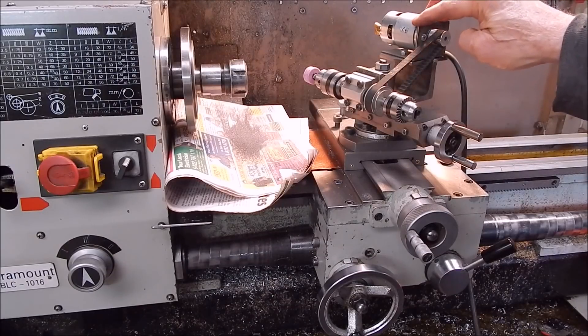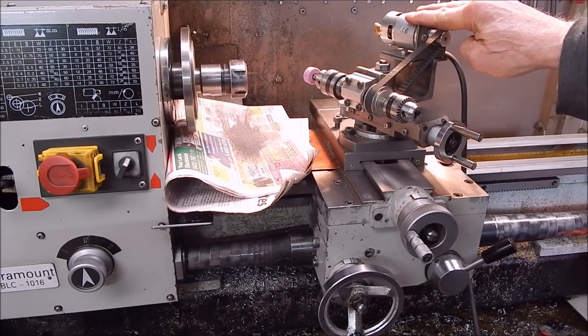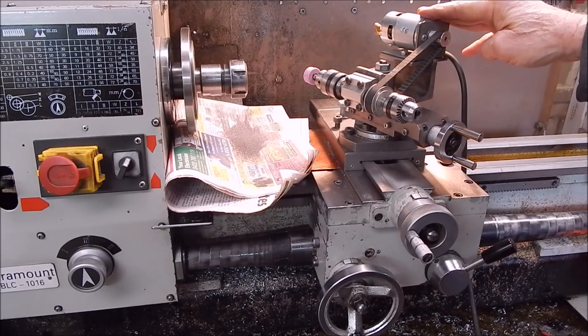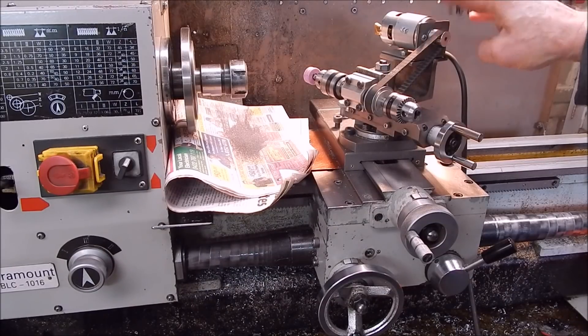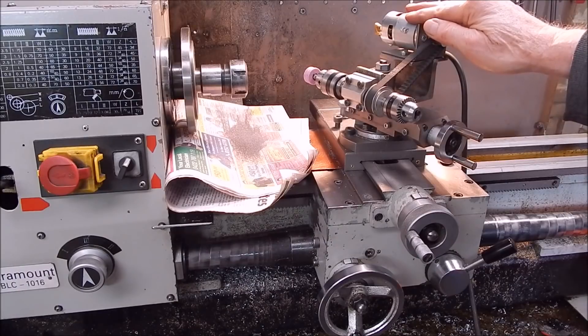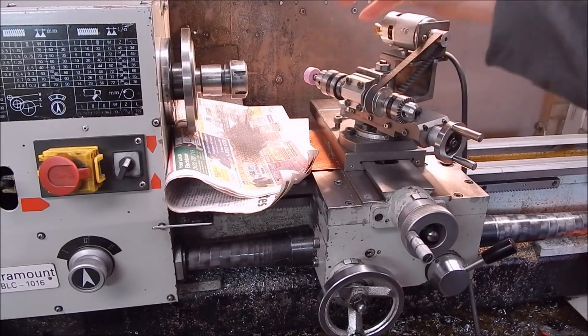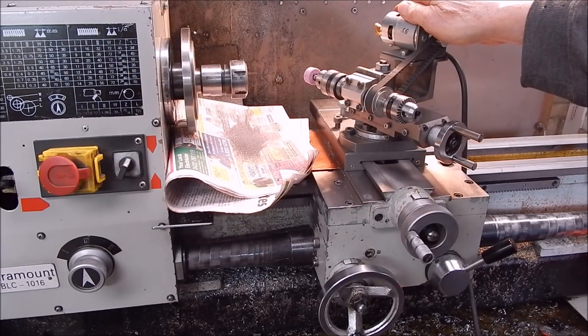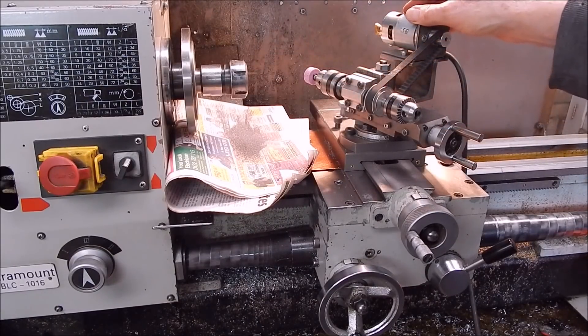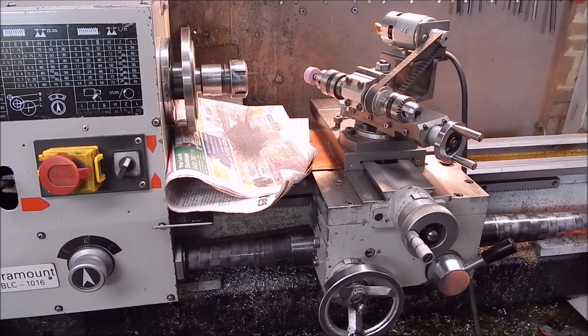Another useful 775 DC-powered spindle — it's like a little tool post grinder, really. Like my shirt — I think it's shrunk when I put it in the washing machine. Once again, super useful. You can do stuff you couldn't do any other way, and it gets 100% accurate. This is just using those cheap stones you can buy in the hardware store for peanuts — you get a kit with a whole lot of different shapes. These work fine for this sort of job; the grit is not too coarse, and it did a good job as you saw. Anyway, that's it from me. It's raining again — winter's here in Adelaide. See you next time. Cheers.